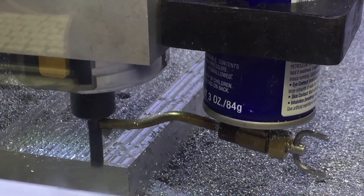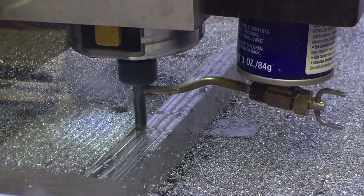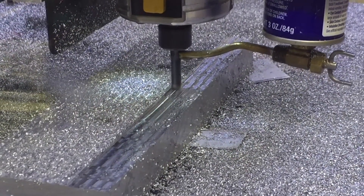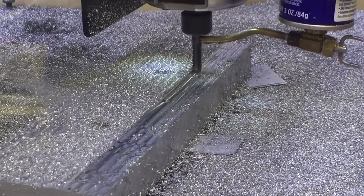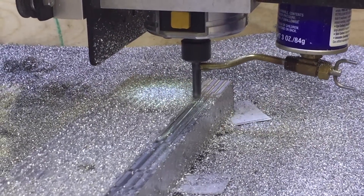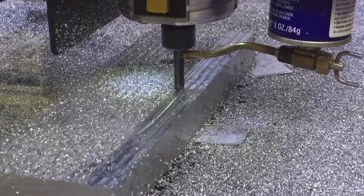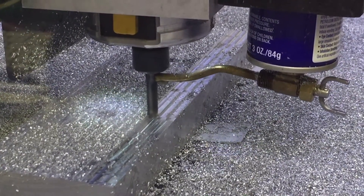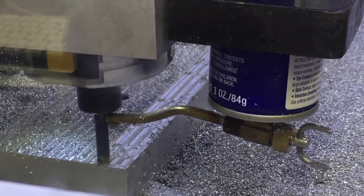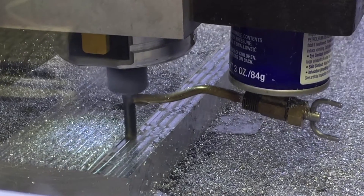Some of you have asked about speeds, feeds, and depths of cut. I put a reference at the end of this section — feel free to stop and write it down or screenshot it. Spindle speed: I run at the slowest the DeWalt router goes, roughly 16,000 RPM. Feed rate is 20 inches per minute; I recommend starting at about 10 to 11 inches per minute and slowly ramping up. Starting too fast will very rapidly show you how unprepared your machine is. Depth of cut is 20 thousandths. Think of this as a high-speed machine where you take rapid, small cuts — that's how it's done in industry. Can the machine handle more? Yes, but that's in the future. Remember: crawl, walk, run.